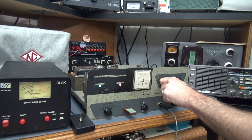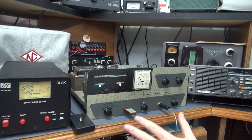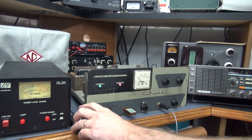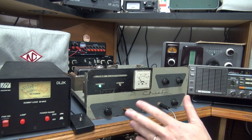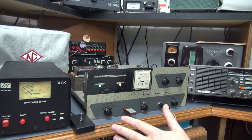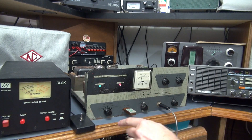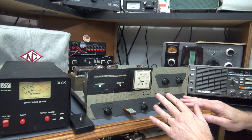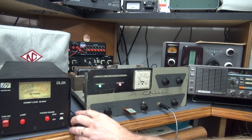I'm going to dip my plate. You can see our output on the Palstar. So let's say you're in the middle of a QSO — you've just sent your transmission. Turn off the PTT; this may be a foot switch or a switch on your receiver, but now you're back to receive mode. Now you're going to transmit again — you simply toggle that switch. You no longer have to rotate the operate switch. Once the transmitter is set up and tuned, you don't have to touch any of the knobs anymore. Your little magic switch does all the work.